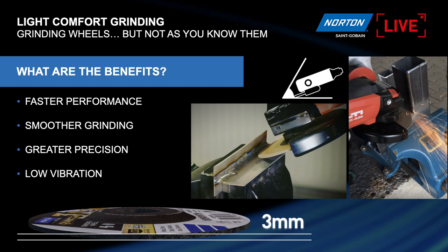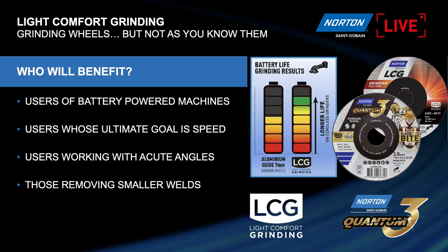The third thing we've looked at is the usage of seven-millimeter or 6.4-millimeter discs. This comes in handy when you grind all day, but how many people really do? In a lot of workshops, operators use a grinding disc only every now and then — you weld something, grind it down, weld again. In a shipyard or offshore applications you will find people grinding all day, but in general engineering it's not common.